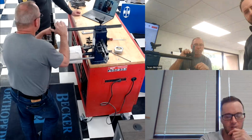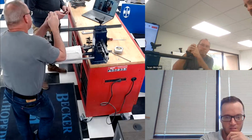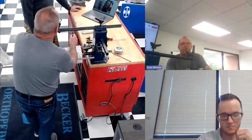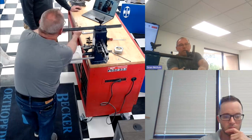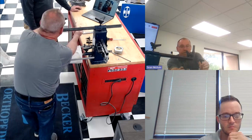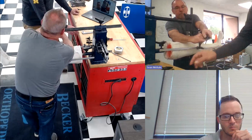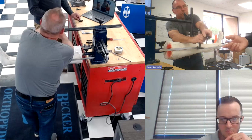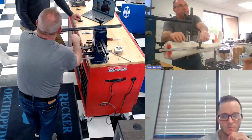We are going to have to modify our T-handles, because the issue we're running into is their threads aren't long enough. So what we did on these, a lot of times, you can use just an Allen bolt or anything that is going to tighten. On this, I just took some bolts. I trimmed off the head. I had the T-handle of my selection and inserted it into the hole and put a small rivet screw. So he basically made his own version with drilling out and pulling. We also can use just a long bolt that has an Allen head in it too, so we just have to figure out some lengths for you.